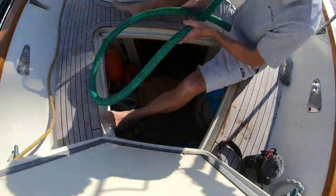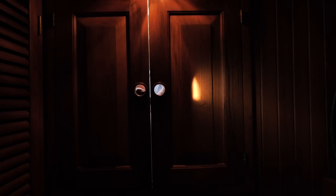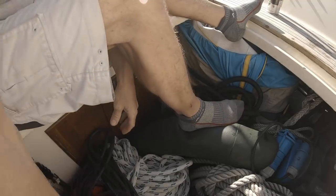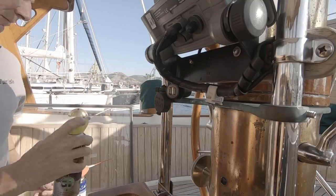You can climb in through the deck hatch into the sail locker, but there's also a hatch that opens up to the fore cabin. I don't find that very useful — I'd rather have it as a crash bulkhead sealed all the way down, with something at bilge level that opened up. The chain locker drains through the bilges and gets pumped out. It might be something I do in future — make it a crash bulkhead. While organizing, it's a good chance to make sure everything's clean for the winter. I put a bit of WD-40 on all electrical connectors, and for USB connectors I use a bit of contact cleaner first and then a little WD-40.